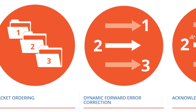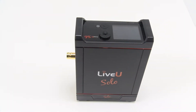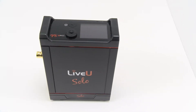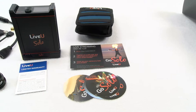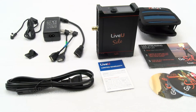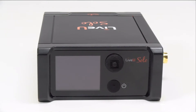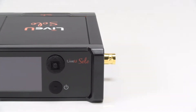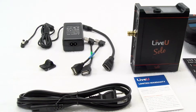The cloud service goes for $45 per month and offers the ability to stream directly to any media platform. The high-profile video encoder found in the LiveU Solo gives it the ability to stream 1080p, 1080i, and 720p formats at a variety of frame rates, as well as PAL and NTSC formats. The audio is encoded using the AAC format, which yields better sound quality than MP3 with smaller file sizes. The LiveU Solo can be powered either by the included AC adapter or by the internal battery, which provides about three hours of streaming according to manufacturer specs.